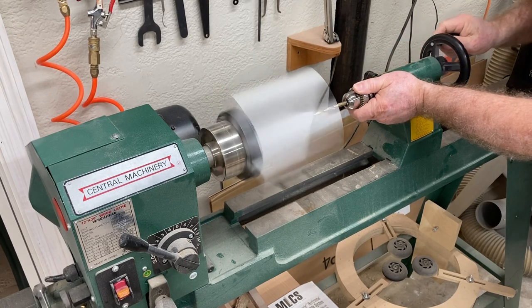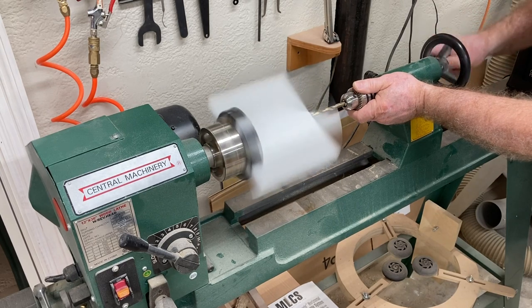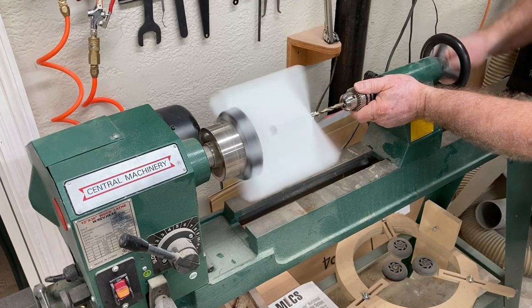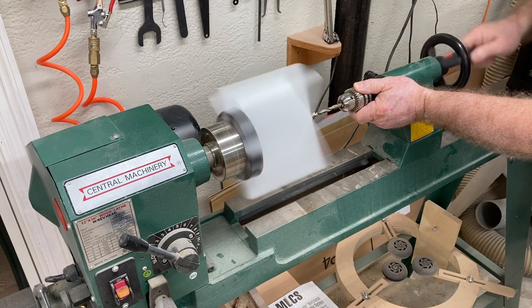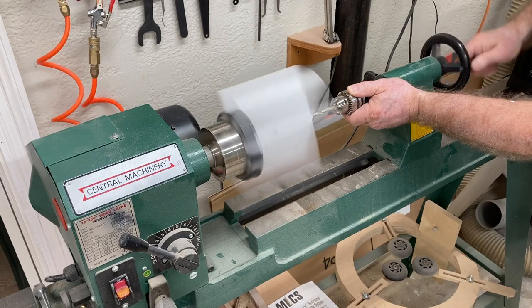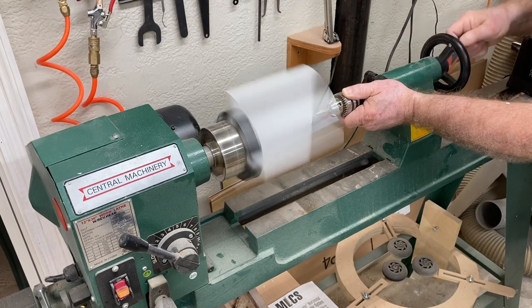This is a 9/32nd drill bit that I'm using to be able to drill this hole into this PVC, and this actually is working fantastic. So why am I using a 9/32nd inch bit? That's because the drip line that I'm using for the landscape hose is 9/32nd. If it was a different diameter, then I would be using a different drill bit.